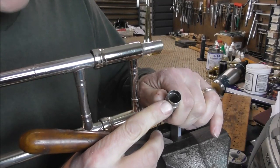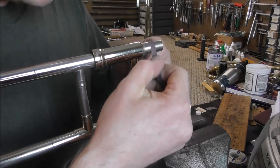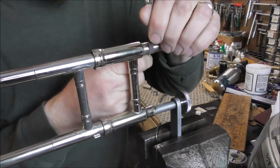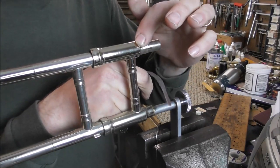You can tell it's clean when it's shiny. And you clean this surface with sandpaper. You only use the sandpaper in places where it's going to be covered up with the joint that you're doing, because the sandpaper does take off lacquer if you start to hit the lacquered spots.